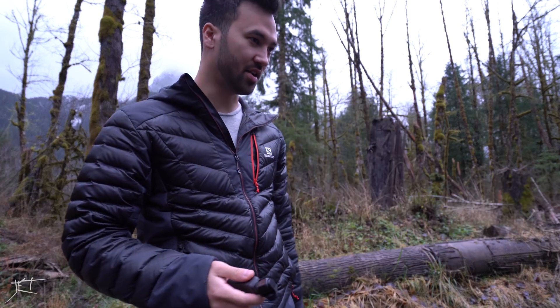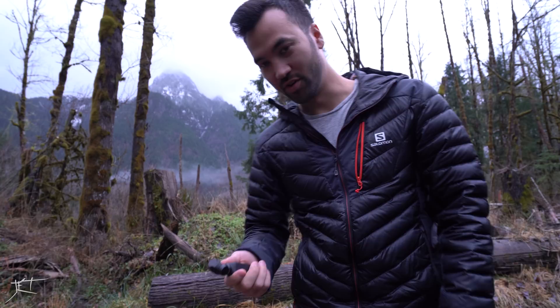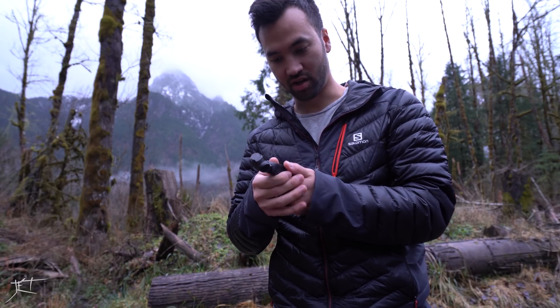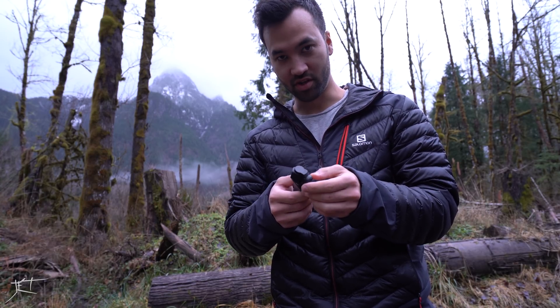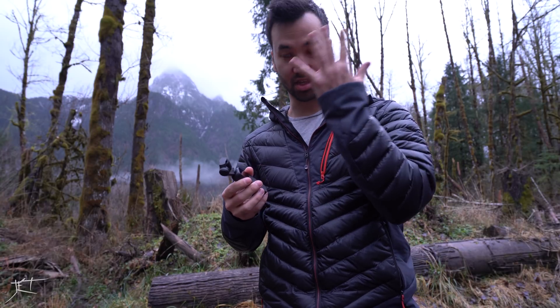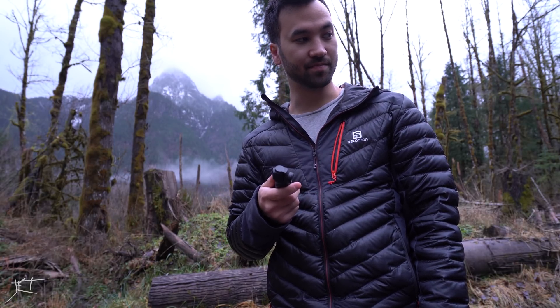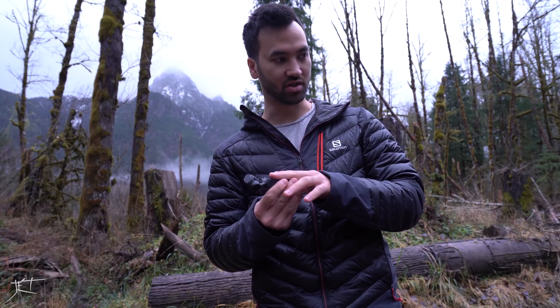I did a little testing out in the open field. It did not turn out the way I wanted, unfortunately. I looked at the footage and it's kind of blurry. I think the problem is all the little vibrations in the drone are causing the sensor or the whole gimbal to jiggle. It looks like this kind of side-to-side motion blur, which I'd assume is just vibrations in the drone. I'm going to try a second time at a different location with a little more padding to try and isolate it.